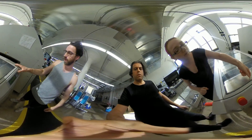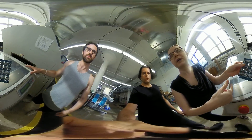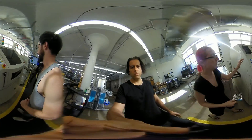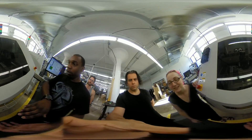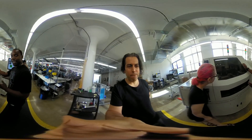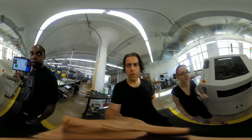We can open this up right now. Each one of these boards has multiple PCBs — not only are we loading in 100 or so panels, but each panel is also like 20 PCBs. So the boards get loaded into this machine, which after the board loader, sorts them individually. Normally back in the day we'd do it painstakingly by hand. Thank God we don't have to do that anymore. This machine saves us a lot of time and effort, and then from there it goes into the next machine, which is the pick and place.